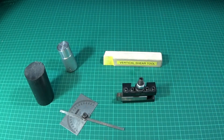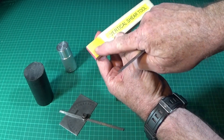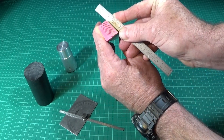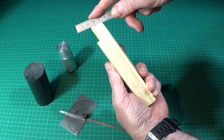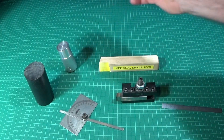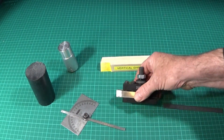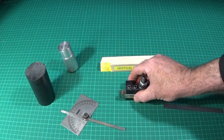I've done a mock-up of the tool here in wood and colored it yellow. On this angle, mine's 18 degrees, and then on the front it's about 7 degrees. There's no specific angle — you can experiment with the angles and see how you get on. I found it very interesting testing this tool with various different angles until I got it right.